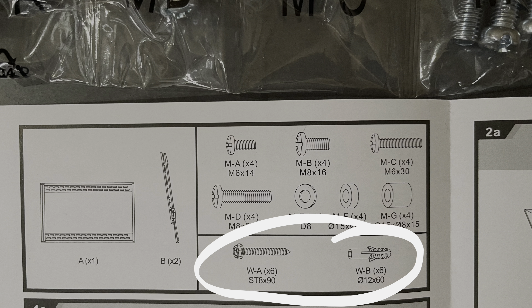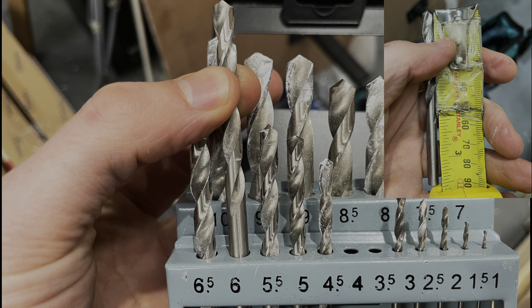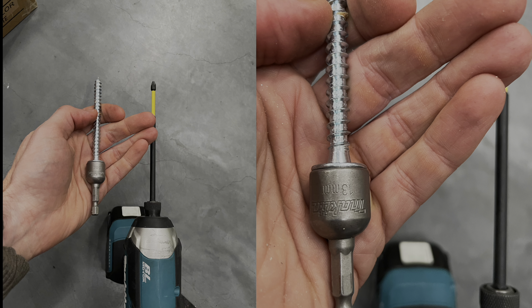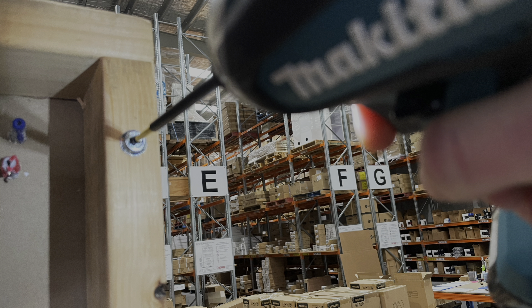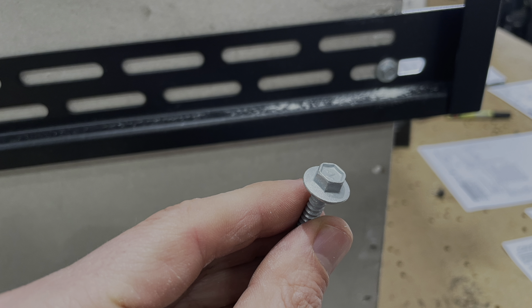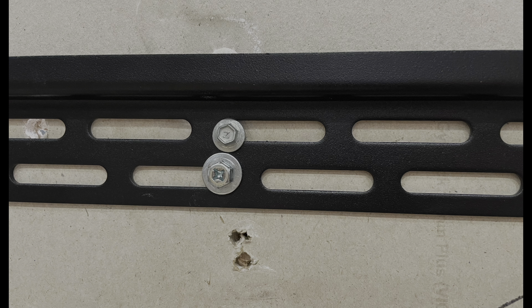Checking the accessories first: we get really substantial screws and wall plugs. Here's a picture comparing them to a wood stud. We grabbed the 6mm drill bit and tested how good these screws are — in testing they were fine, they didn't break or wear. I also tried with the Phillips head and that's fine too. In this case I'm just going to use roofing screws. This bracket gives you two rows to mount your screws, so I'll take advantage of that and use both rows with roofing screws.